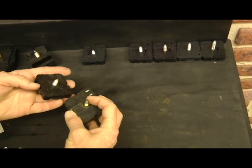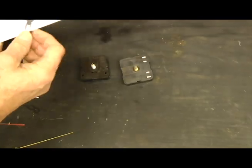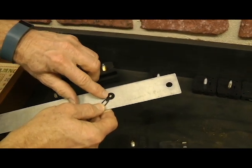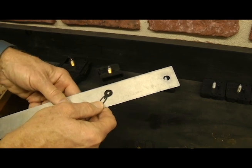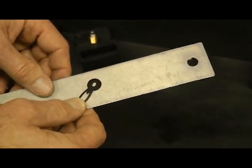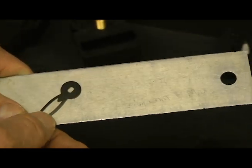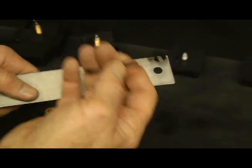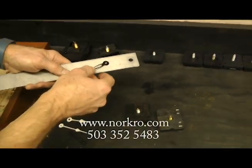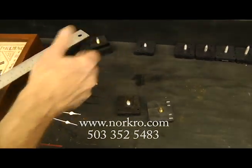The shaft looks pretty good. The hands are the same — they're called I-shaft hands. That means that the hole in the minute hand is oblong shaped and that hand is held on with a small nut. Sometimes you're going to run into hands that are pressed on. If that's the case, that hole will be round and you cannot use those hands on an I-shaft movement — they just won't fit. So if you order a movement from us, go ahead and get a pair of hands. Most hands up to four and a half or five inches long are a penny a pair, so make sure you get new hands when you get a new quartz movement.